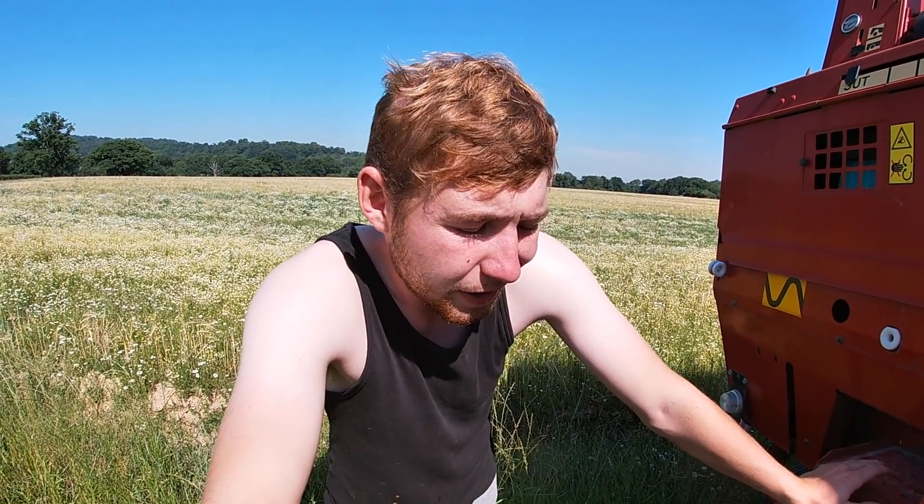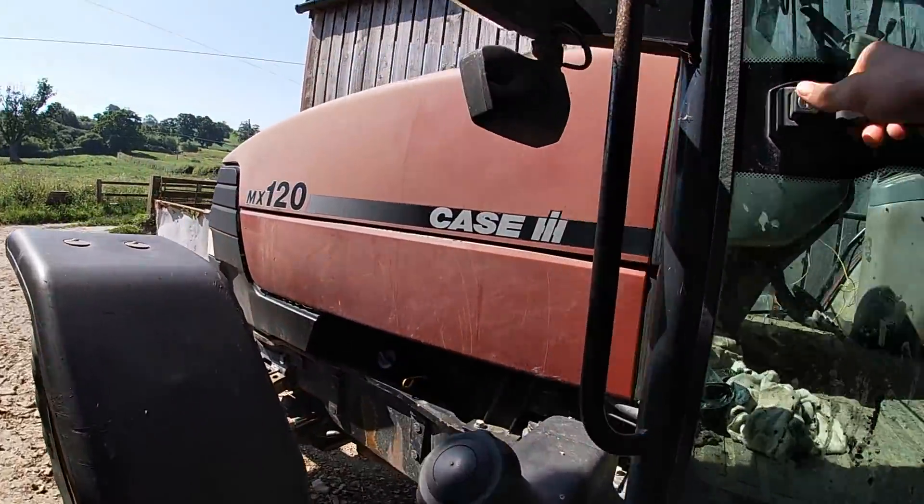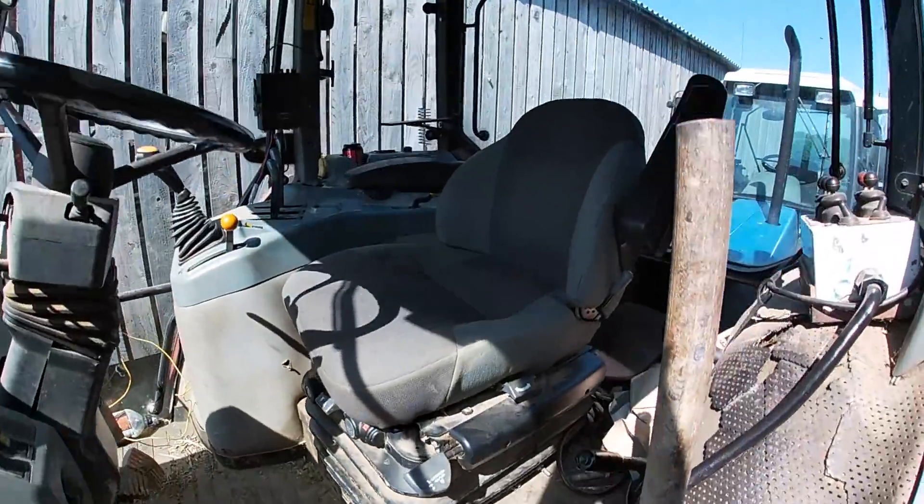Usually within the wheat we are baling straight behind the combine, because if you get rain it's a nightmare to sort out wet straw and it just costs money to mess around with it. So today I'm going to be getting this ready — not really a lot to do, just going to run it up, grease it up, make sure all the oilers are working. I'm going to go and fetch a tractor. We'll just jump on the MX, move this out of the way, stick the baler on the Ford — the drawbar's already on that.